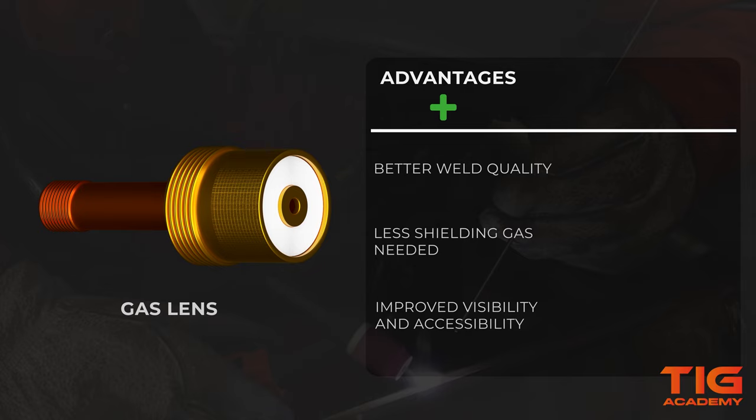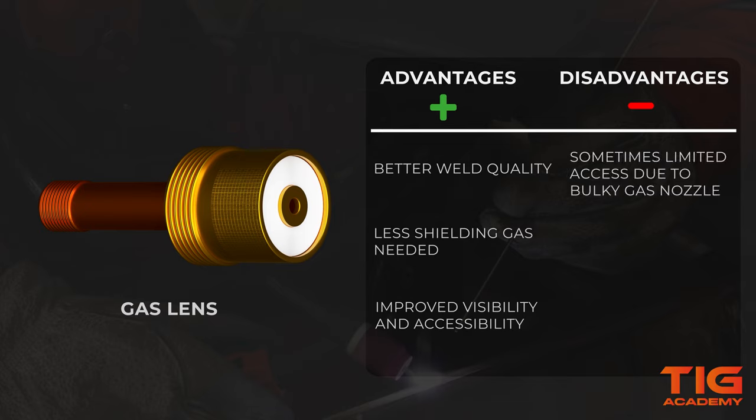However, in practice that's not always the case. There are some disadvantages to using a gas lens. Generally, you will get better joint accessibility because of a greater tungsten protrusion, but the gas lens style cup is more bulky than a standard one, so joints with limited access are not always easier to reach. And even though you are more likely to get better weld quality with a gas lens, the mesh screens can get blocked by bits of metal sticking to it whilst you're welding — that can ruin your gas lens and then you will need to buy a new one. Gas lenses are more expensive to buy compared to standard collet bodies — a gas lens can cost up to five times more than a standard collet body.